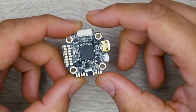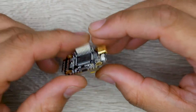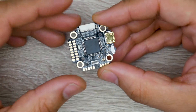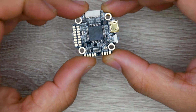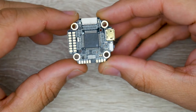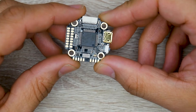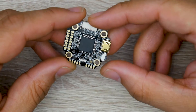If you take a closer look you'll see two holes in the middle of the board — this board can run both an ICM and an MPU gyro. The default built-in gyro is an MPU-6000, which is the one we really want. Since we're capped at 8K in Betaflight, there's no need for the ICM gyro, however you can buy this with both gyros installed. You can choose in Betaflight which gyro you want to use. If not, just stick to the MPU-6000 — less headache and it just works, especially if you're new.